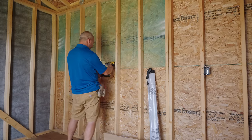Are you using the 14 here? Want to get about an inch and a quarter stripped. If you don't strip enough of it, you end up having not enough room to work around in the box. You've got to wrap the whole screw, right? So make it easy on yourself. Start upside down. Pinch the width of this plier. Bend it over. Okay? With an inch and a quarter stripped, and you do that, you'll always have direct contact with your screw. And then, nice and healthy.